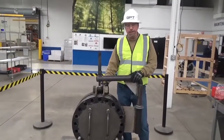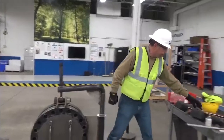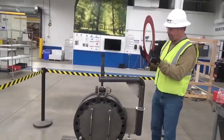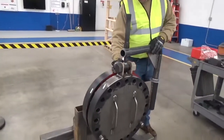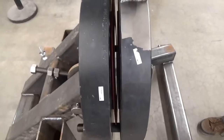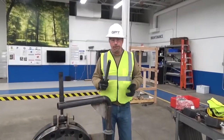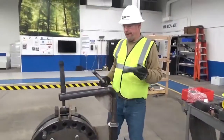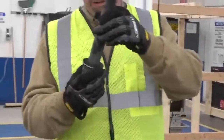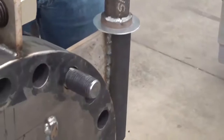We've got a couple of bolts in that help align the flange. It's extremely important to make sure your flange is aligned and there's enough space to just slide the gasket in. Here we've got enough space — we can just drop the gasket in and the bolts will center the gasket. That is a proper installation. Don't use screwdrivers, crowbars, or hammers to try to beat the gasket into place — if you're doing that, you don't have enough room in your flange and you've got to open it up with flange spreaders. One tip: you may want to install the sleeve first rather than the stud first and then the sleeve. If you put the sleeve on first, make sure the sleeve goes inside the washers and then install it through the bolt holes — as you can see, that was much easier.